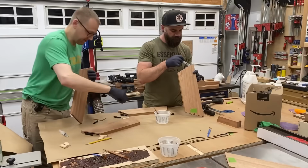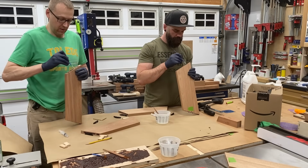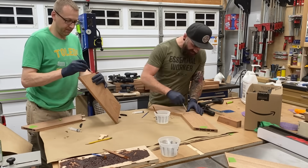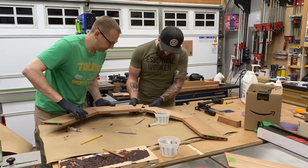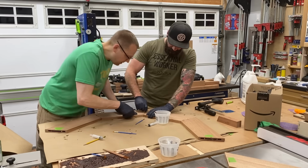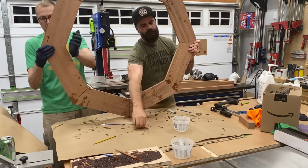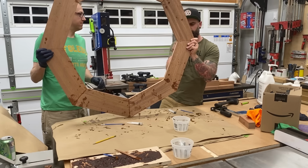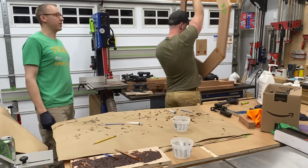That's awkward. Then we glued up two halves of the octagon shelf. I'd insert some epoxy, insert the clips, insert the dominoes, and tighten everything down, making sure not to glue up our final seams, because that's what we would use to take it apart and hopefully slide it smoothly around our tree. So as you can see here, we have our two halves glued up. We put our last halves together without epoxy and tighten it down, creating a perfectly made octagonal shelf thingy-mabob.